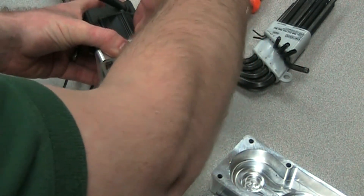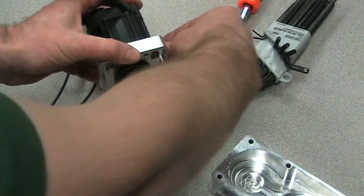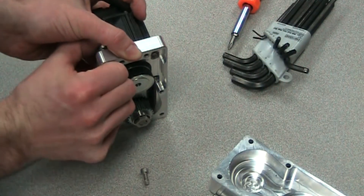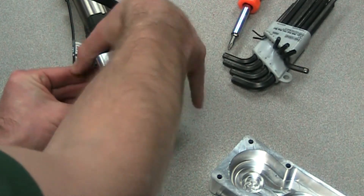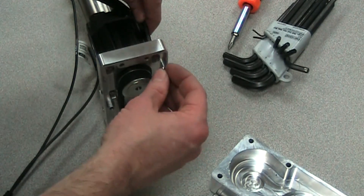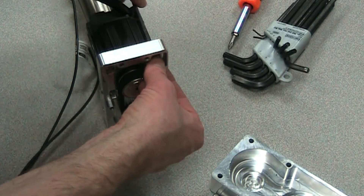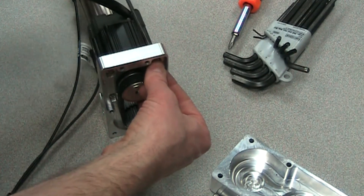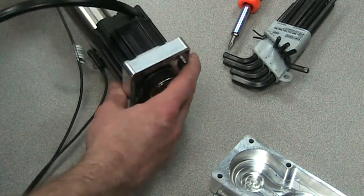Once that's complete, we can feed our screws in through the motor and into this housing. We'll lock those in. Once those are in position, we have four nuts that will go onto the inside of the housing and hold those screws in place. We'll want to install these in a cross pattern so that the motor is square and flush with the motor mount. With the RP — the reverse parallel mount — you'll want to make sure the motor stays seated inside of that pilot.